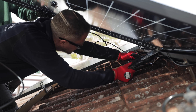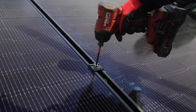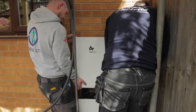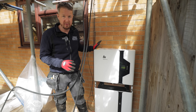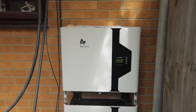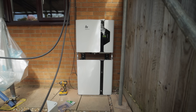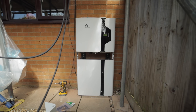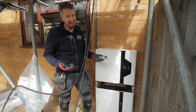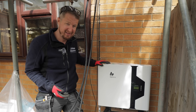You can see under here how the light passes through the panel, reflects off the roof, and back onto the reverse side of the panel where you also have solar cells generating solar energy. This is the mystery battery I was talking about earlier — it's one we've not installed before. It's an Alpha ESS system: 5kW hybrid inverter, 5.7kWh modules with 5.4kWh usable, and you can stack up to five modules. It looks smart, it's designed to be installed outside, and apparently it's really easy to commission.